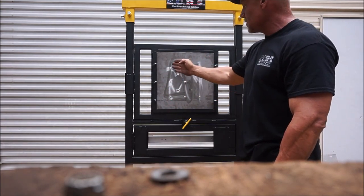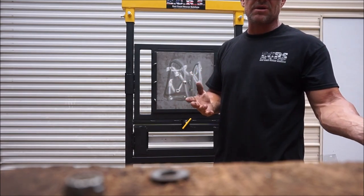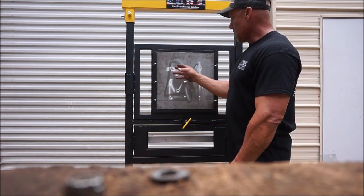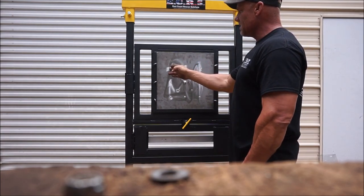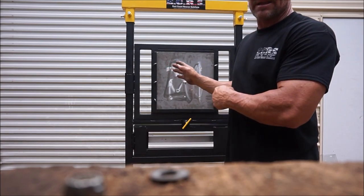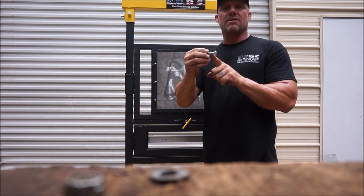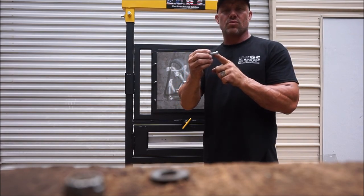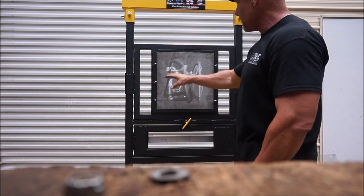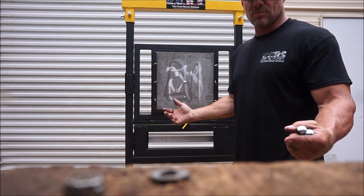You can fill all these holes. This is the typical pattern you're going to see when you encounter carriage bolts holding a security device such as a drop bar. I've designed it so it's far enough from the prop that you can make a good 45-degree cut and get beyond the carriage square part into the threaded portion of the bolt — that's where you want to go, it's where the least resistance is. Make the cut and the prop can still be used again. Keep many carriage bolts on hand to enable a lot of repetition when you're teaching.